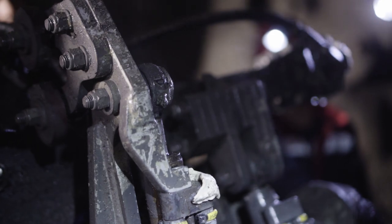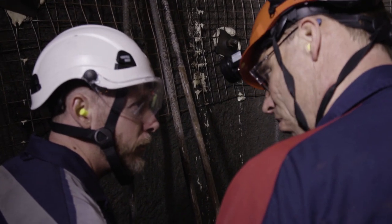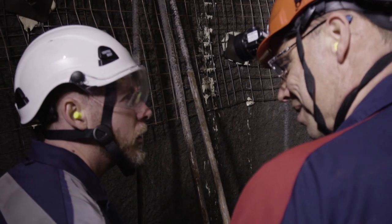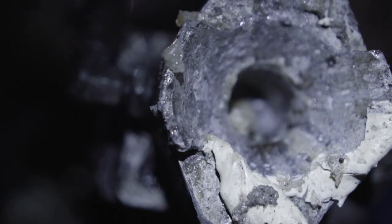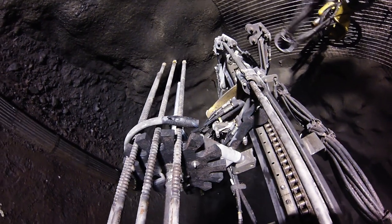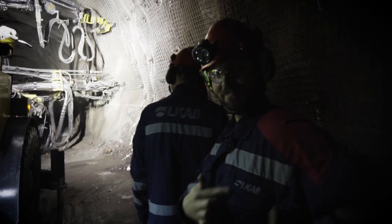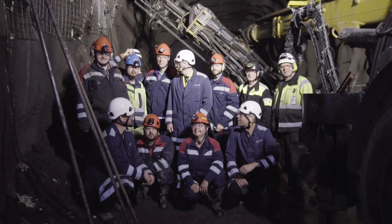The two parts of the resin are brought from the back of the machine through hoses to the front of the machine. They are mixed in a mixer right before the resin is injected into the bolt, and then that resin goes out from the end of the drill bit and encapsulates the entire bolt from its deepest point — and that's how it actually anchors instead of being placed in a cement-filled hole.